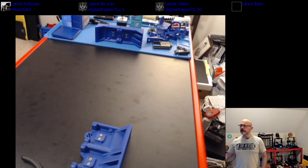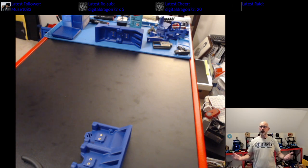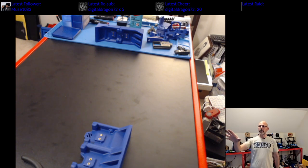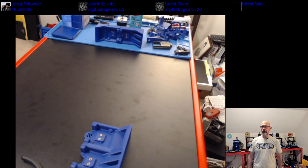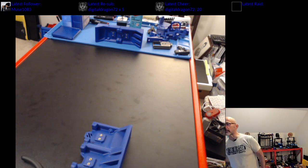Yeah, so I use an iPad Pro. And the nice thing is with Klipper, all you need is a web interface. So I can sit up here and manage all the printers behind me, but I can also manage the two that are downstairs in the dining room. And if I'm going down there, I have a screen that I can also interface with. But the Zero G, I haven't put a screen on. So I'll just grab the tablet and go down there and get started. And if I need to make any fine adjustments on the Z offset, I can just fine adjust it.